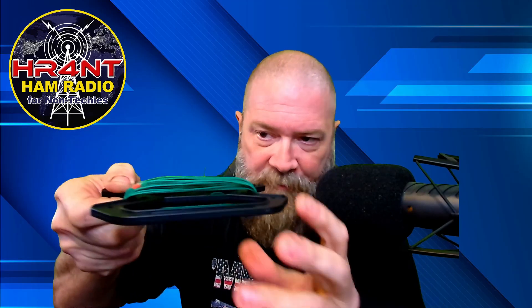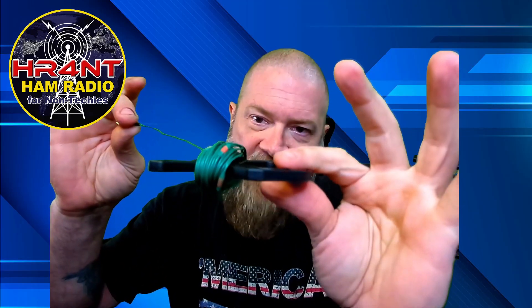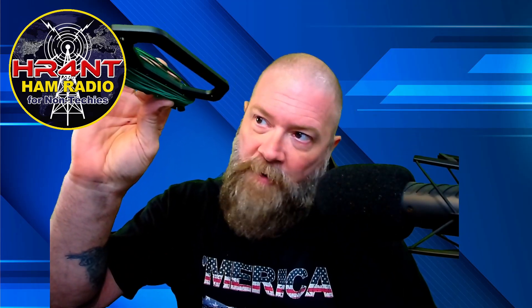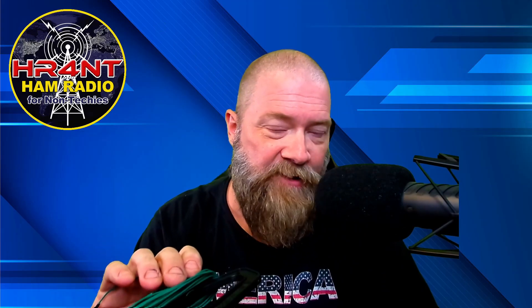We also noticed something about height. Instructions say to keep this cable two feet off the ground, but we found that in some instances — I have it on video — lowering it down on the stick helped. Shane from this side of the radio mentioned going to Lowe's to pick up one of those little electric fence posts, and that's fantastic — if you're going to have this antenna, you've got to have one of those. By lowering it down, maybe only 18 or 19 inches at the other end in some instances, our SWR dropped and we got really killer results.